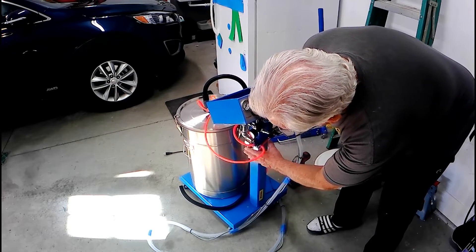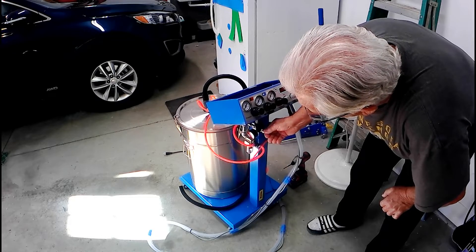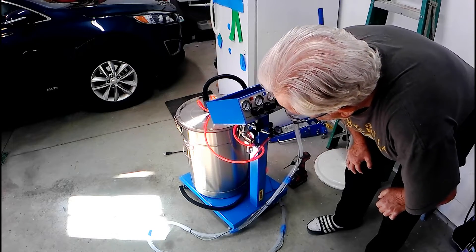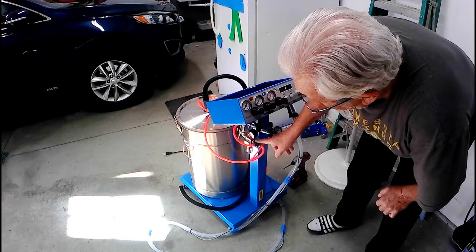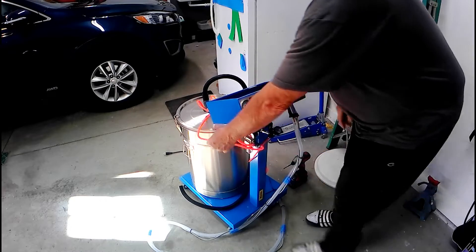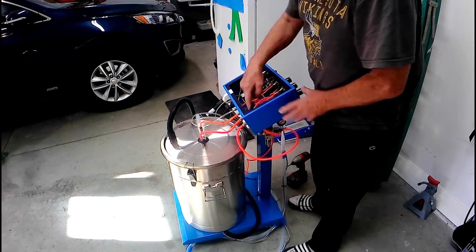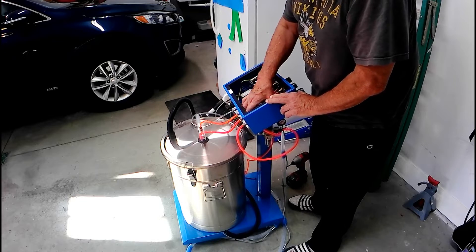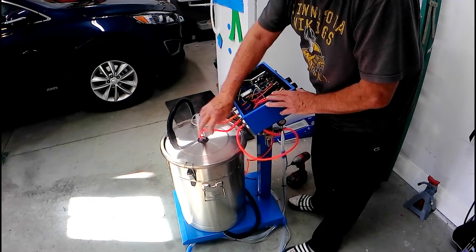None of the gauge and pipe parts come with it — you get the vapor collector and water collector but not those additional fittings. I was going to make a bracket but ended up using a zip tie, which worked out pretty good. Air comes in, hits a T — which for some reason they don't pre-assemble — and goes up into the first connector labeled 'air.' Inside it goes to a T that branches out to two other gauges and an electric valve.